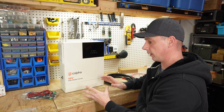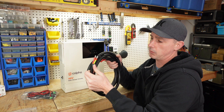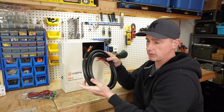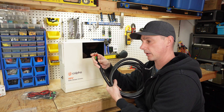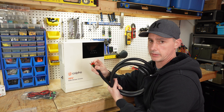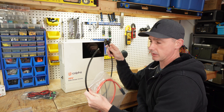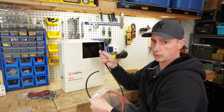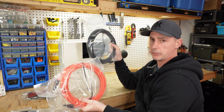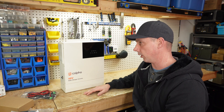With this unit I got the battery cable kit as well. With the battery kit we have some wires that already have the ferrule connectors on here, meant for connecting your AC output — 7 gauge wire, black, red, and green/yellow. I'm going to put a piece of white tape on my red to signify that it's my neutral. We also have a set of MC4 cables that you can use as jumper cables — connect your solar panels directly here. We have a black and a red, and then some length of PV cable to run out to your panels.